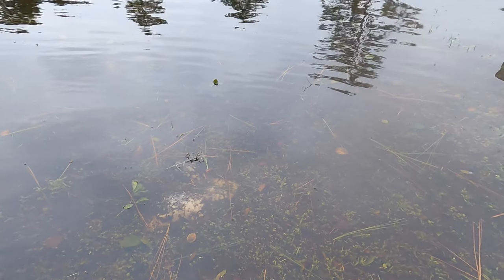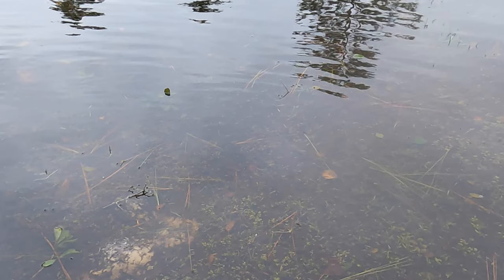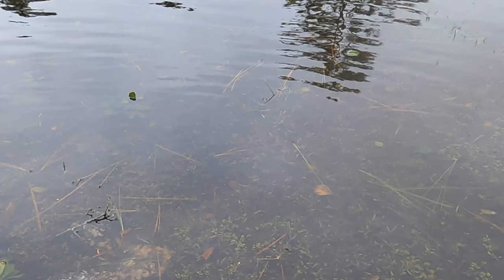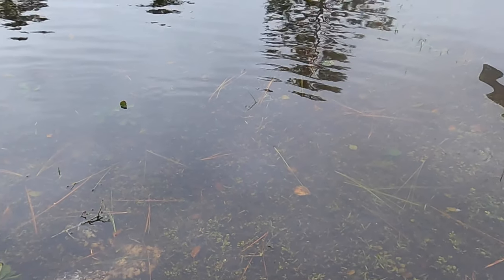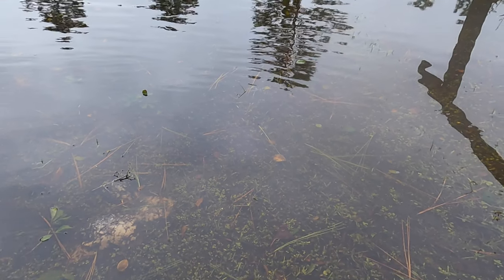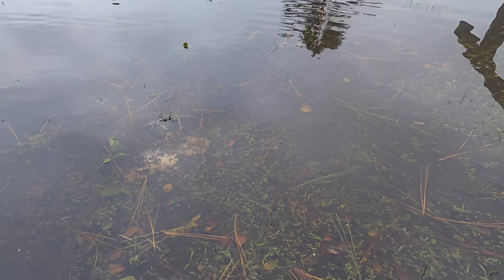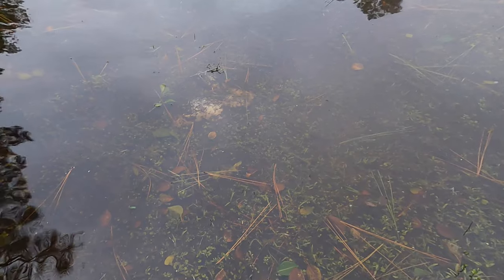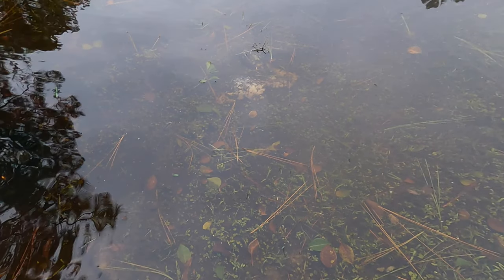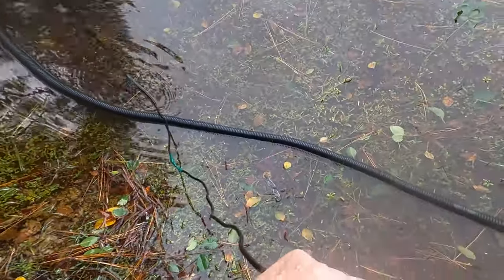Because the backyard is totally flooded and there is a great French drain system here, we still need to drain this water — otherwise it's going to sit here for days and days. So basically what I'm going to do is dig a hole, put a bucket and a sump pump in, and actually lift the water up and pump it out to the catch basin in the front where I know it's draining great. We're just going to plug it in.